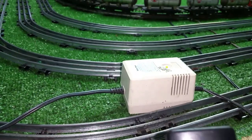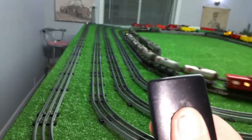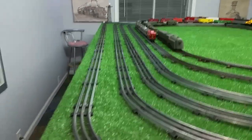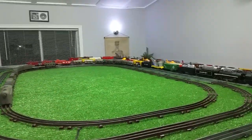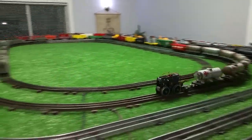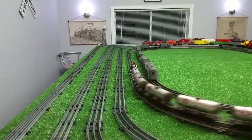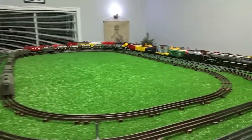And then to regulate the power, I'm just using a lamp dimmer plugged directly into this transformer. And as you see, it actually works quite well. But like I said, you could run this on a car battery, but very likely I'll just get a couple of diodes, hook it up to that motor, and run it on AC. That runs really well. An interesting experiment.